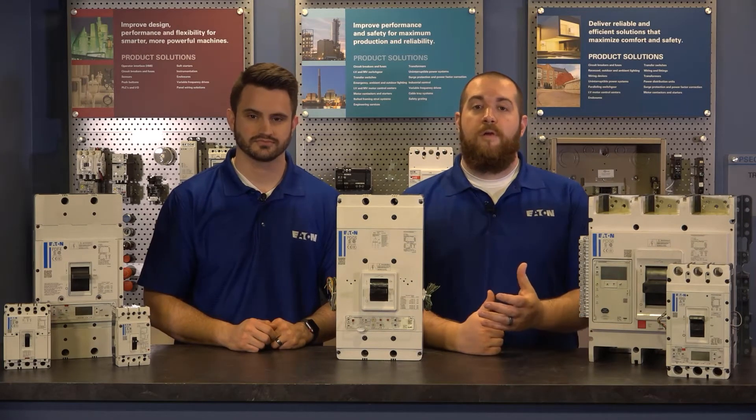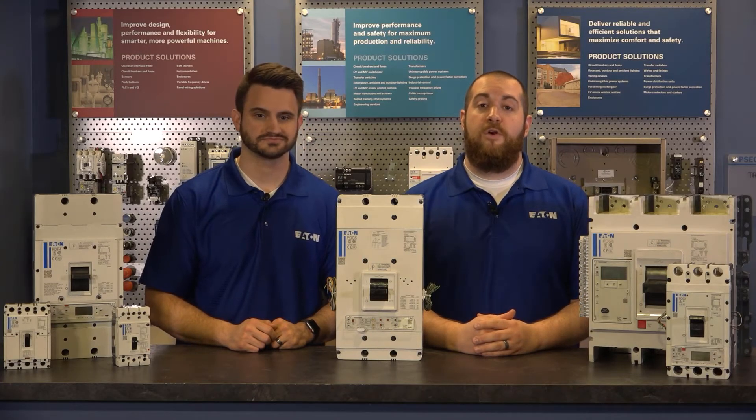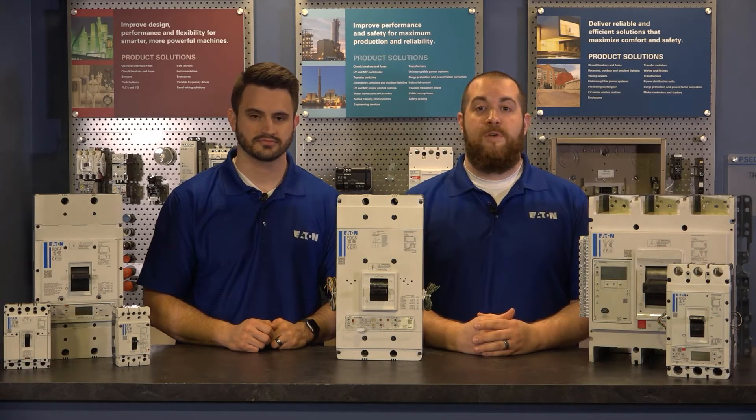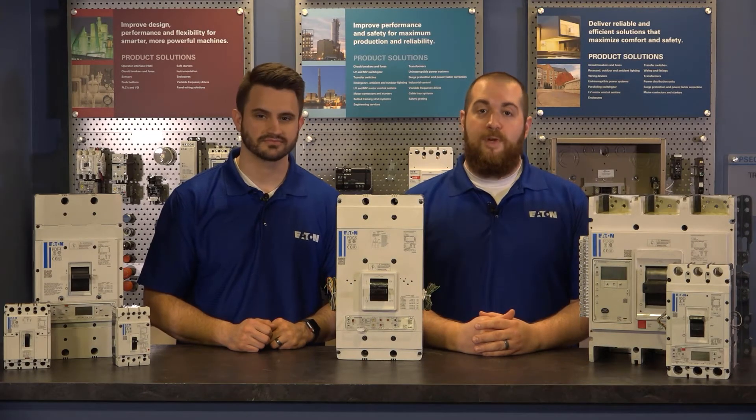This globally rated circuit breaker provides electronic protection with Eaton's state-of-the-art PXR trip units and has both an 800 amp and 1200 amp construction. Carrying continuous current ratings of 320 amps up to 1200 amps, the PD-5 is available with interruption ratings up to 150kA at 480 volts and has a 100% rated current option. The PD-5 trip unit featuring integral metering and breaker health is also field interchangeable and can be configured with ground fault protection, alarms, and multiple communication options.